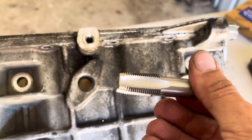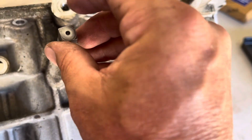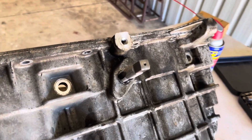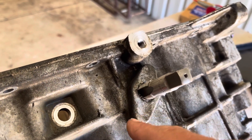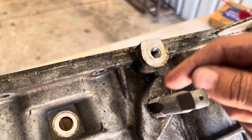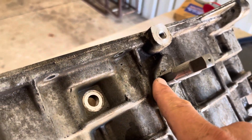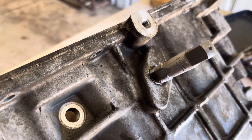The sump is aluminium and these are a hardened carbon steel tap. The hole is quite small but I'm hoping the tap will just cut its way through. I'll get some lube on there and start cranking. I've started cranking on that with the ratchet, very slowly and gently, trying to keep it as square as possible - and it's finally starting to bite. At first it's just chewing out the aluminium, tapping its own thread, but now getting deeper it's actually cutting the hole properly. The good thing with a BSPT thread is it's a tapered thread - that's what the T is at the end - so it gets bigger as it goes in, and will actually bite into the aluminium more as it cuts deeper.